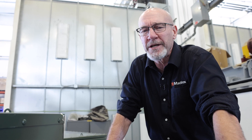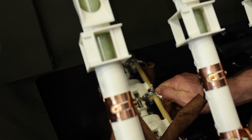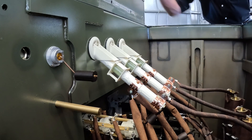What I'm going to do here is remove one of the leads from the tap changer, and by doing this, it's going to affect the results of the turns ratio test. I'll remove the second lead on the second phase of the tap changer and this will affect the results.